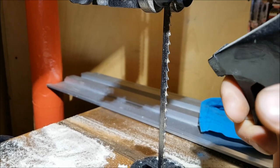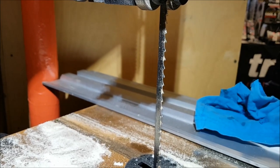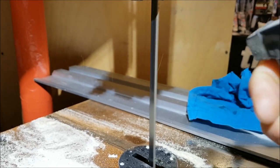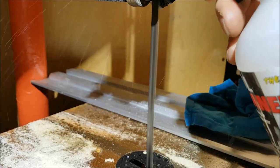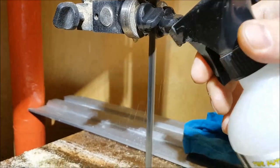What I like to do is turn the bandsaw on and then squirt the Trend cleaner on the blade — you can be pretty generous with it. You can squirt some on the guides there as well if you'd like, since it'll help lubricate those too.